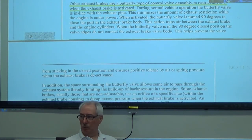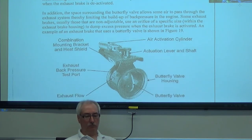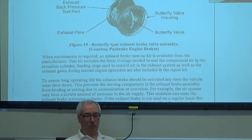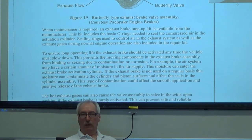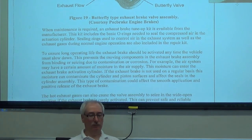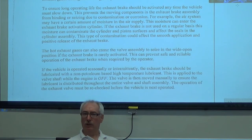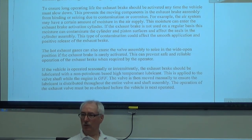The third option they mention is the variable geometry turbocharger — you can close the vanes on the turbocharger to trap the exhaust system pressure. Off-road haul trucks use engine retarders, not exhaust brakes, though they may have an engine brake as well. Mike is going to film the class so he can go back and review it later, and we'll provide a link so you can replay it if you need to.